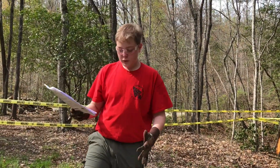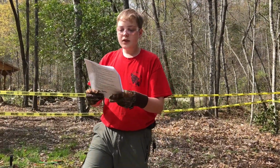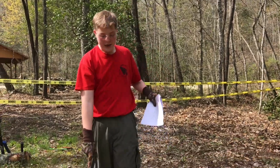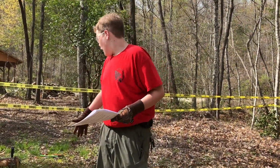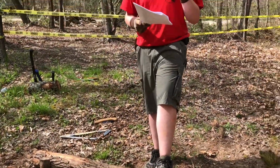When cutting a down piece of wood, firewood, like I was demonstrating, brace the long piece of wood against a chopping block, sawhorse, or other solid support, like I did here, and then let the weight of the saw pull the blade through the wood. Both of these saws are heavy enough that I did not have to put any downward force into it.